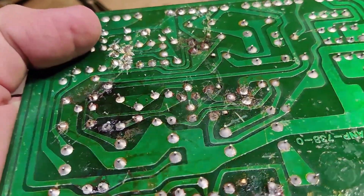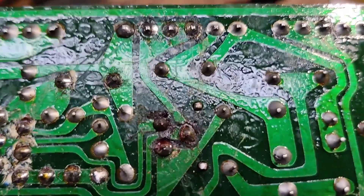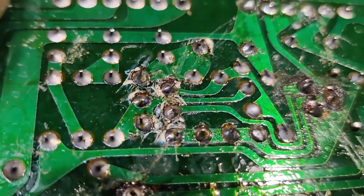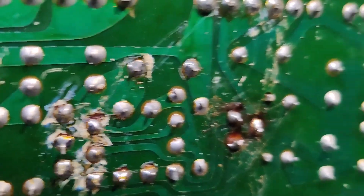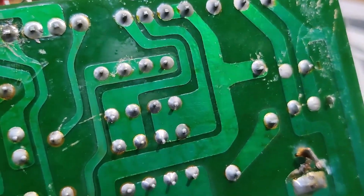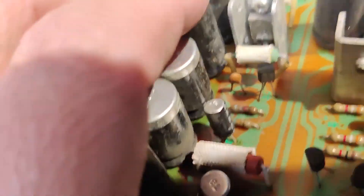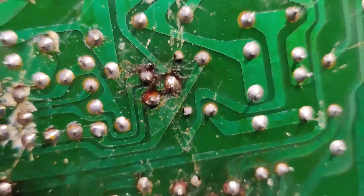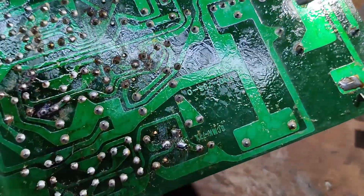Inspecting the back of the board, you can see where there has been some work, but there is also overheating from the transistors and some decay from the flux — though it looks okay, I don't see any major trace damage. Over here is nice and clean, that's what it should look like. But here we have the transistors that are running quite hot. We'll be replacing those and beefing up the heat sinks. You can see where they've overheated, but I've seen a lot worse than that, so we're good.